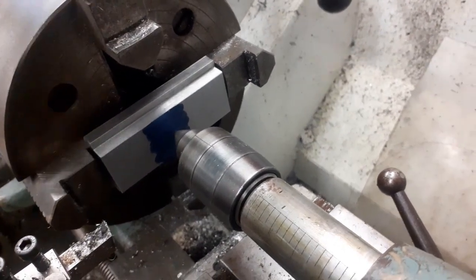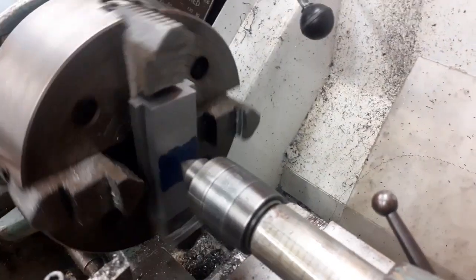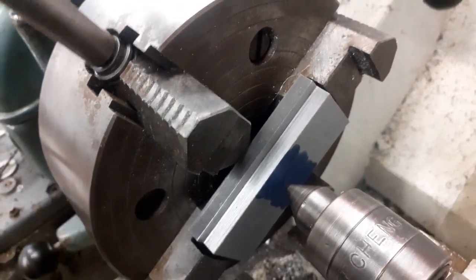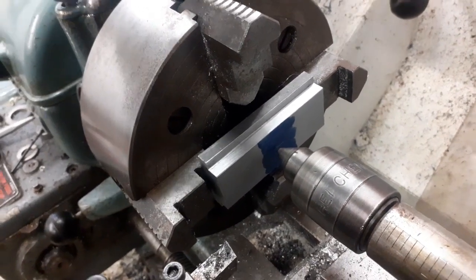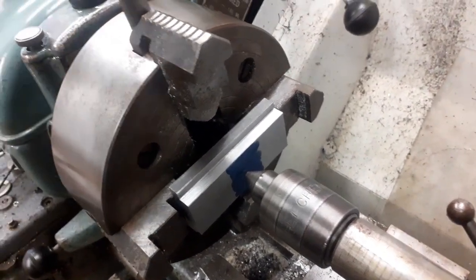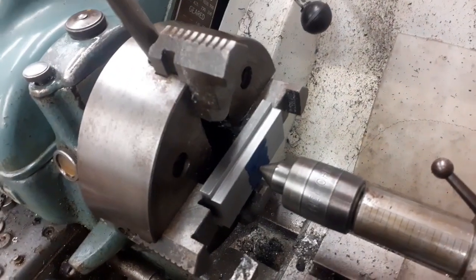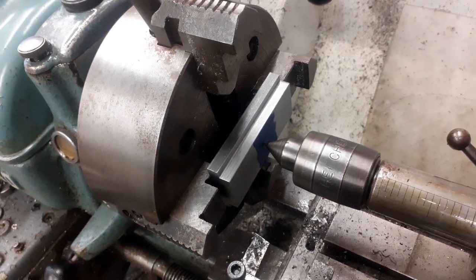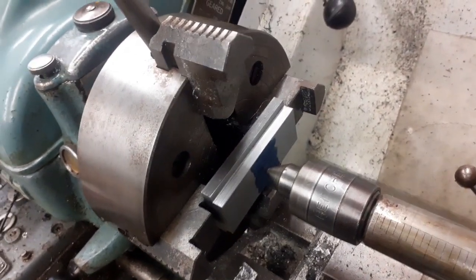So having marked up and centre punched the workpiece, now stuck it in this 4-jaw on the Myford, because I've got a tool post on this one. I'm just using a running centre sitting in the centre punch to line it up while I'm getting the jaws sorted out, and the next move will then be to get that centred using a centre finder to make sure it's spot on, and then I can drill through, tap 5/8 BSF, and then counterbore the top to take the alignment bush.